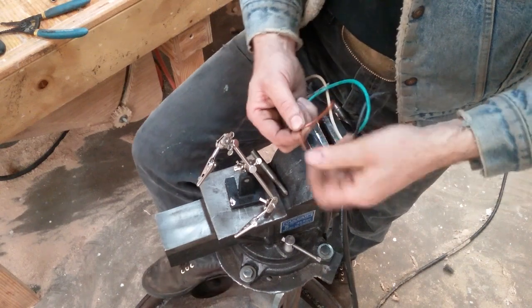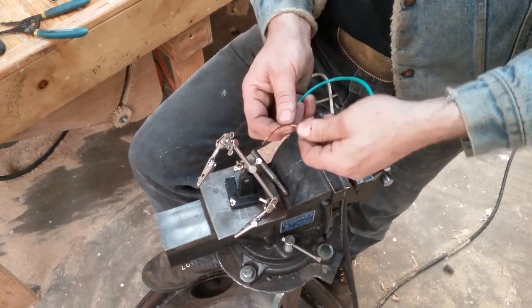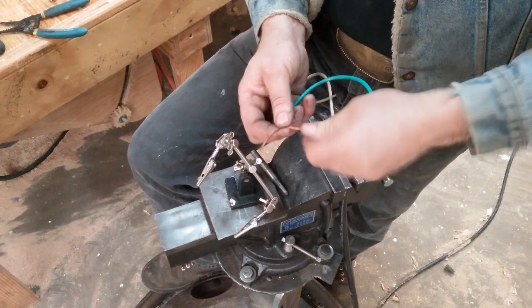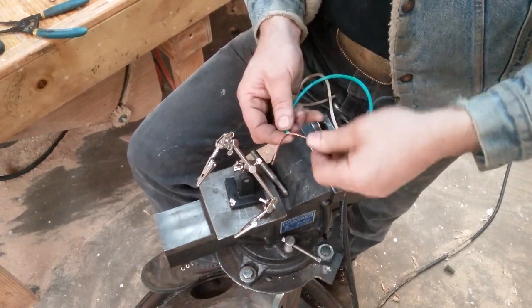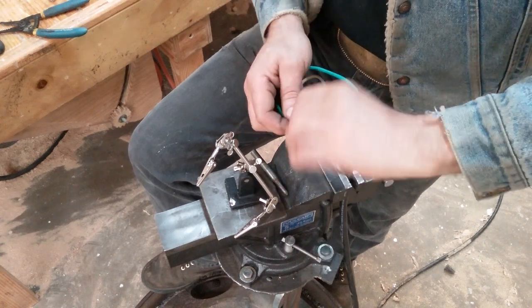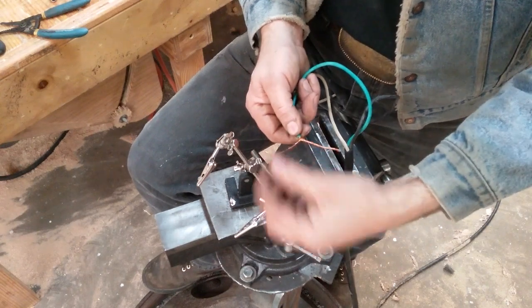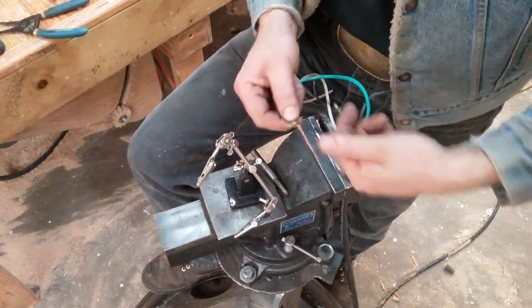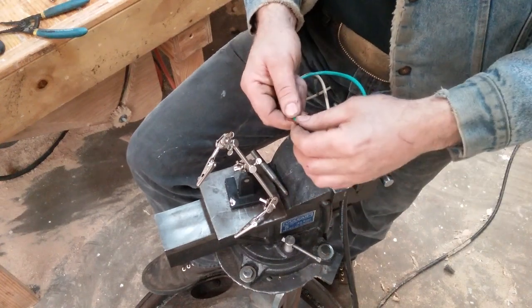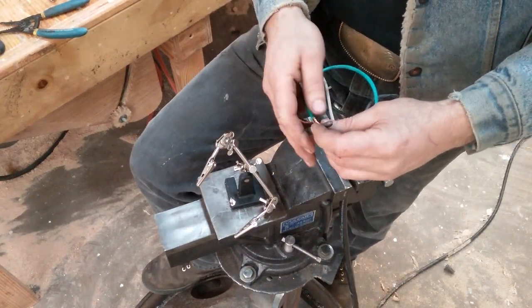What I'm doing here — this is 12 gauge SJ cord. Ignore the color code because the color code doesn't matter. This is DC control circuitry and they make up their own colors; I'm just copying what was there. So what I've done is split the wire basically into two halves, twisted the two halves, and now I'm twisting them back together. This is going over a 5/16th stud.